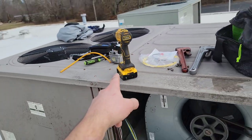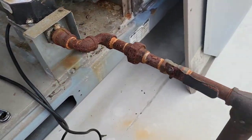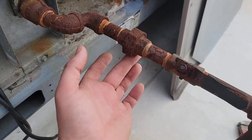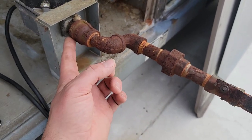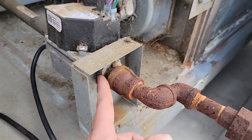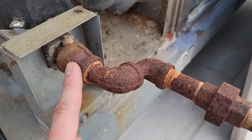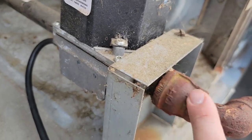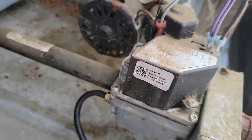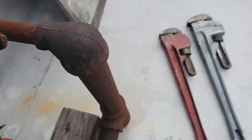To replace this gas valve is pretty easy. I've got two pipe wrenches and some thread sealant. I'm going to loosen this union right here and then take this connection loose so I can put the new gas valve in. Notice the inlet pipe connection MPT thread fitting is three quarter inch — we've got a half inch street elbow going to a half inch to three quarter bell reducer, and the pipe going to the burner assembly is three quarter inch as well. So this gas valve is three quarter inch in and out.